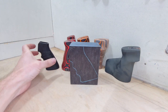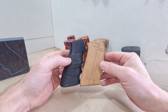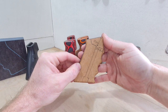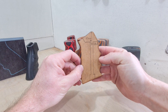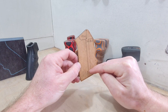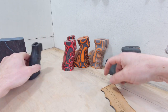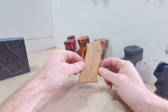These do look quite complicated, but if you imagine that's what's inside your grip — so if your grip was cut in half it would look something like this. If you're trying to drill that at an angle it'd be fairly awkward, but considering we've got a parallel line here and a right-angled fixing bolt hole, if we make the grip and jig it up to cut the slot and drill it and counterbore it all in the same jig, we can keep it completely upright, offset at its 30-degree angle — which is the angle of the fixing bolt that drops down through the center of the grip — it means it's going to be an awful lot easier.